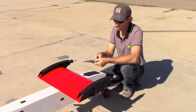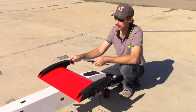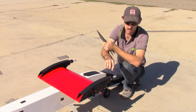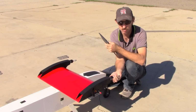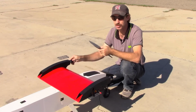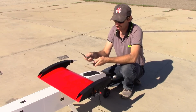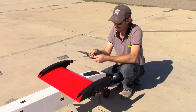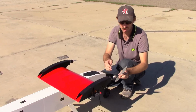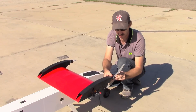The correct direction for the motors to turn is inward toward the top. If you look at the top of the motor, it would be rotating to the inboard part like this, and the same on this motor. So they rotate toward each other at the top. The P propeller, or the pusher propeller, will go on the right side of the aircraft, my left. So we put that on,